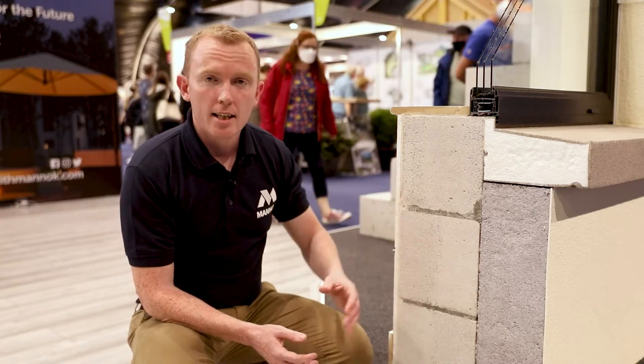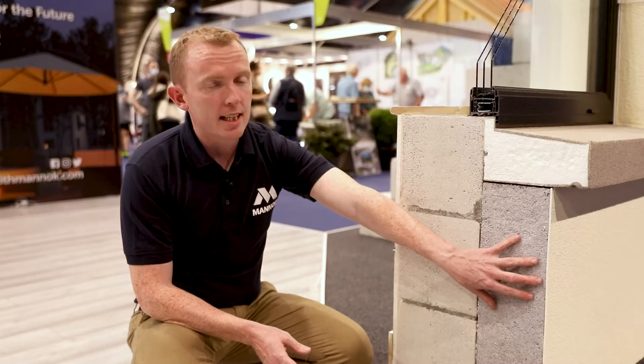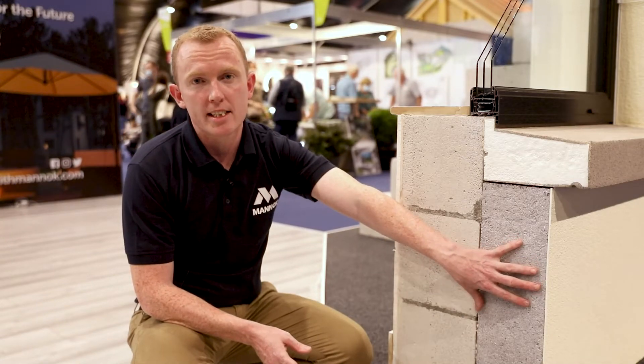When he has that built, the roofer puts on the roof and the windows are installed. The inside finishes and first fixing can take place. And then the specialist contractor comes along and fits the external insulation on the outside. Externally insulating a building is probably the best way to insulate it — you're essentially wrapping your structure in high performance insulation, and that overcomes all your thermal bridges by default.